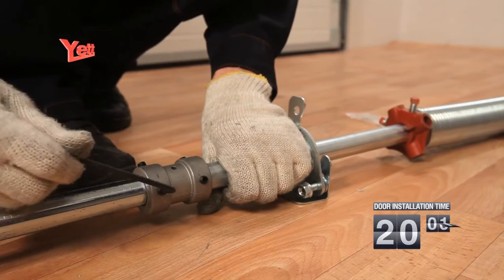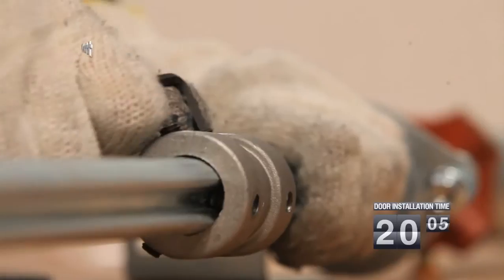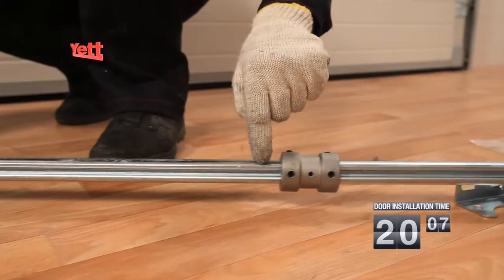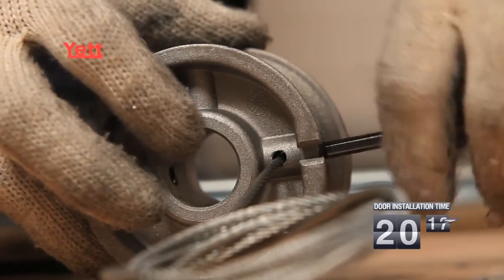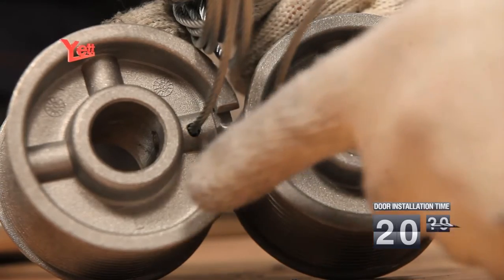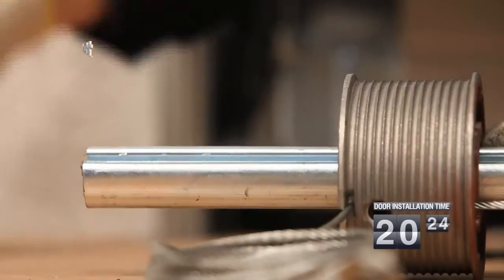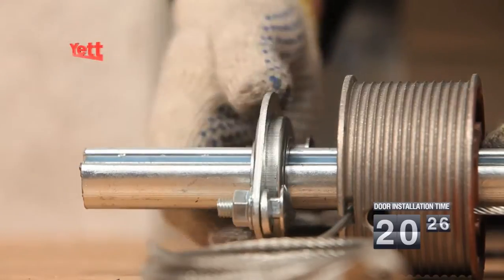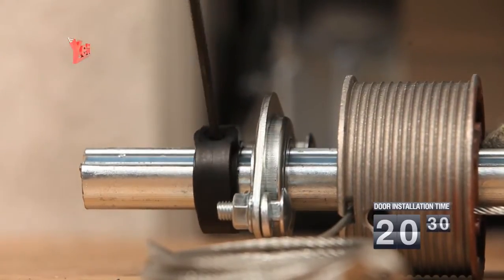If the design provides for splitting the shaft in two, the torsion mechanisms are installed one by one. Shaft connection is made by means of an adjustable muff. The pull rope is established in a drum and fixed with the help of bolted-on connections. The lock ring on a shaft of the torsion mechanism is fixed with the help of bolted-on connections.